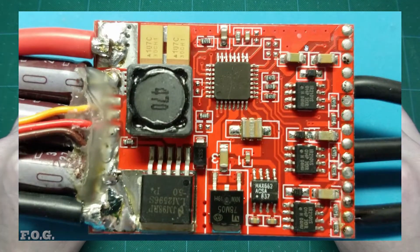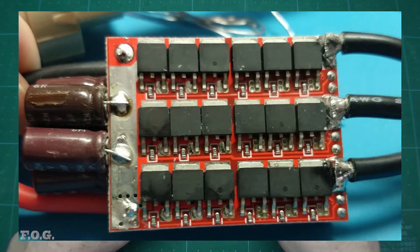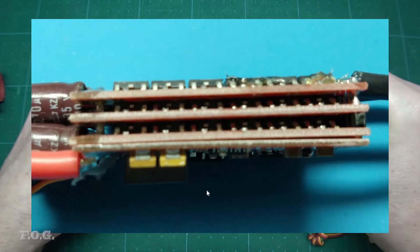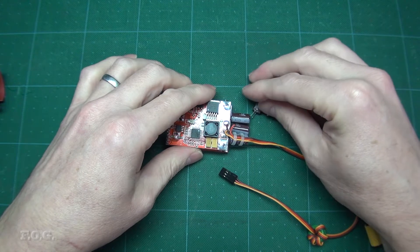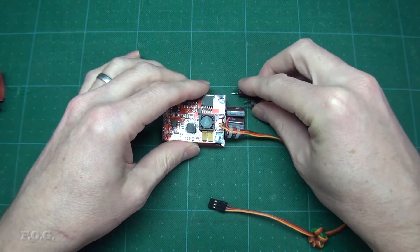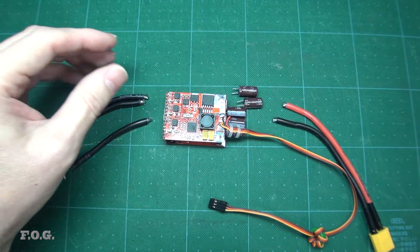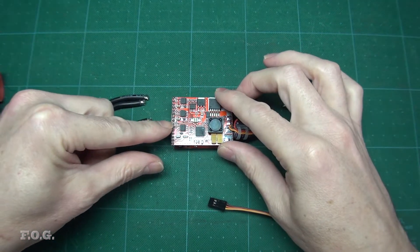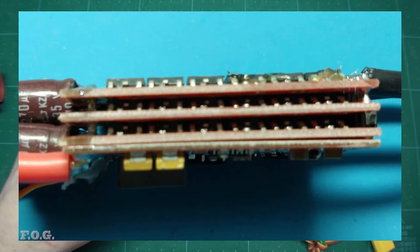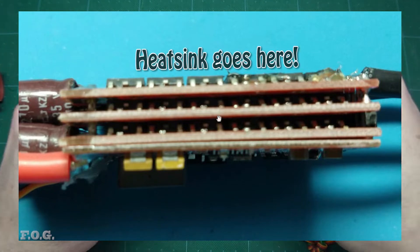With the cover taken off, you can see there's a main board on top and below that there are three identical MOSFET switching boards. All four boards' power inputs are soldered together using big wire holes for the plus and minus rails. There are also five 270 microfarad capacitors soldered onto the boards in different locations, but all just connecting to the same power input — likely there to take up any slack for fast current demands.